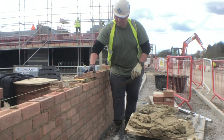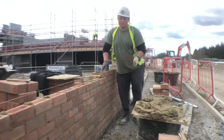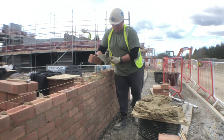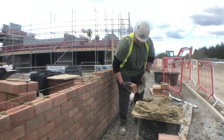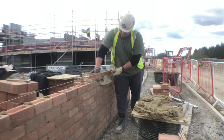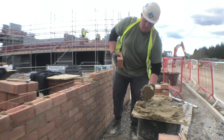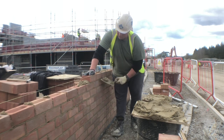If you build the footing yourself then you can range down to the first course. I don't really tend to range down when building the corner — I tend to pull each individual end brick. I know it takes a little longer that way but you're always going to check that your corner is running pretty true. I also like to put a tingle at the end of each brick when I move the line up — just out of habit. I find it gives the line a bit more stability and stops it jumping around.